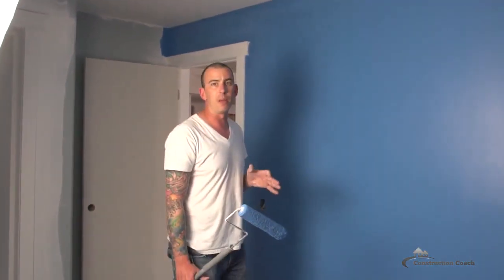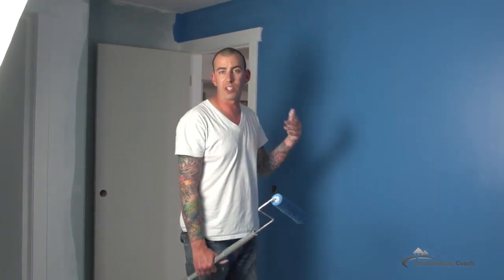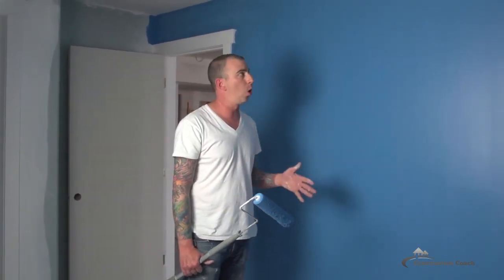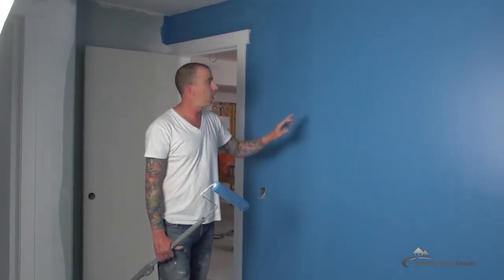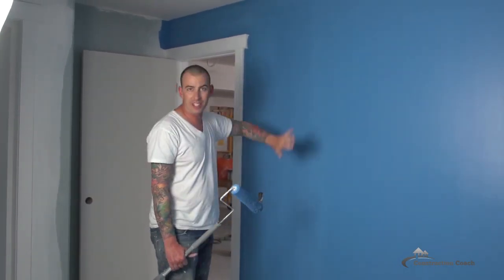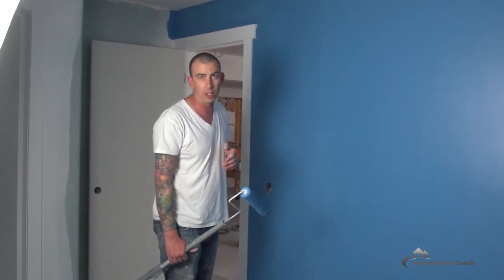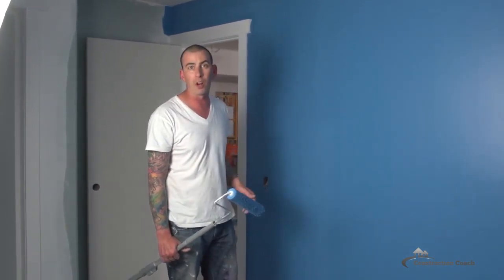Also, with the tinted primer I had on before, I wasn't able to see a couple of screw holes that I've also got to patch up — there's one there that's shrunk back a little bit and another one right there. The more time you take and the more things you notice as you're going through the painting process, the better your walls will end up being. Once this is dry, I'm going to check for areas like these screws to patch back in, give it a light sanding again with my pole sander, and hopefully get one more coat on. If I spot more deficiencies, I'll be putting on a third coat.